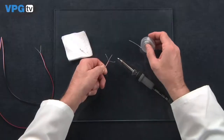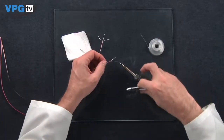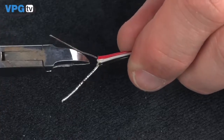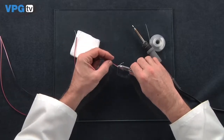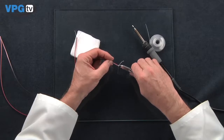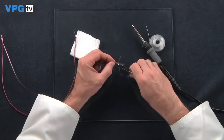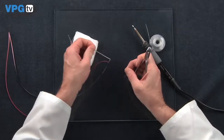Using wire cutters, make a small split about 1/4 inch between the red and white insulation at the gauge end. This will help to align the bundles with the tabs and ensure that there is not a connection between the red and white wires. At the instrument end of the lead wire, make a small split between each bundle. Split the wire back about 2 inches or so. This will allow an easier connection to the strain gauge instrument.